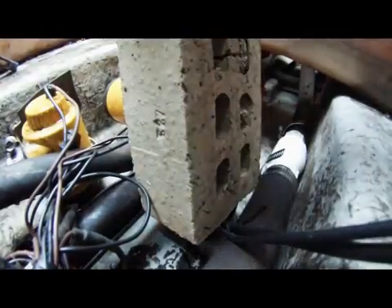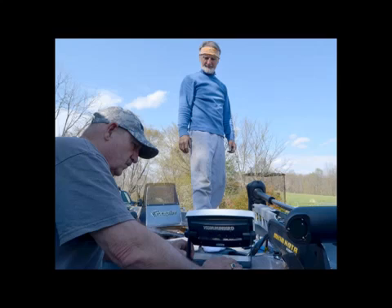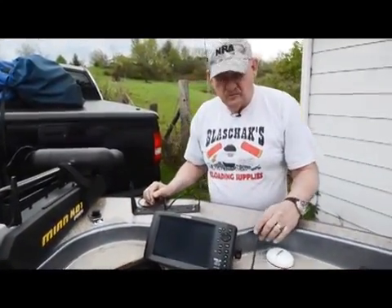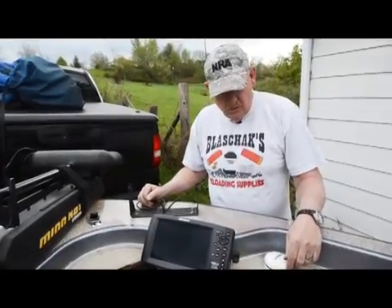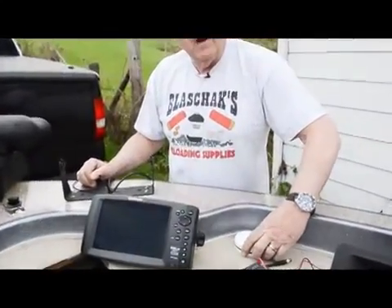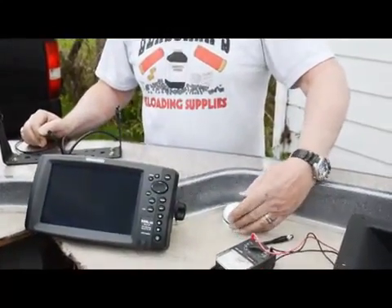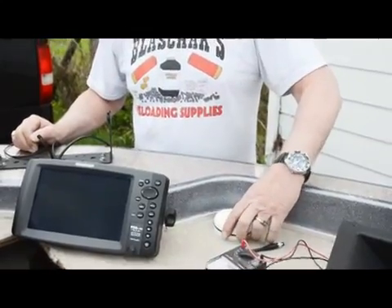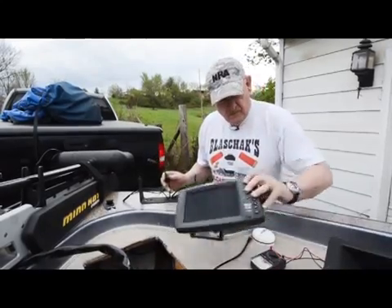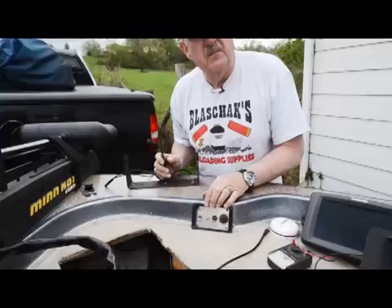Thanks to my preparation, this installation has held up through pounding boat rides on Lake Champlain and Lake Erie. Before installing the Humminbird unit on the bow, I had Bob move it around to find the best position — a flush mount worked best. Once we mounted the unit's bracket, we installed several cables. The GPS module was positioned in the corner to keep it out of the way and avoid a trip hazard on the bow, so we drilled a hole to route the cable underneath the deck.